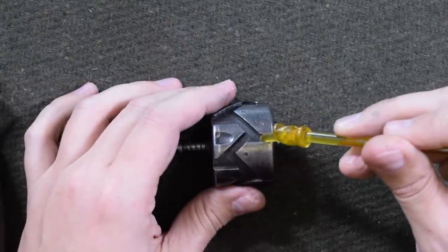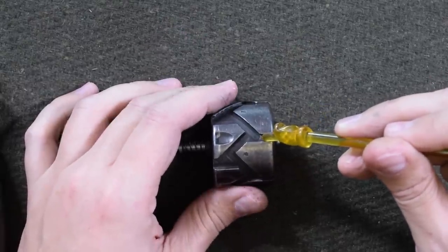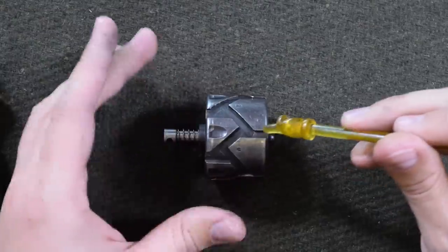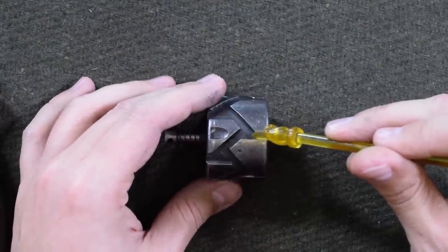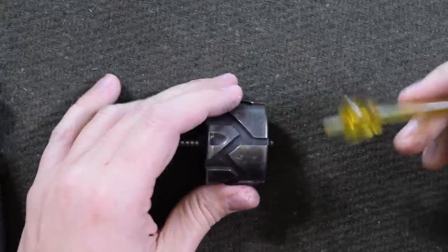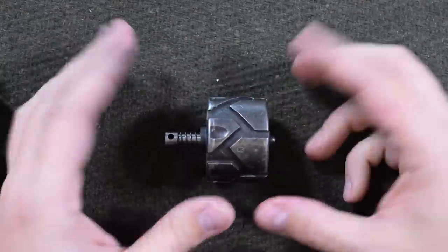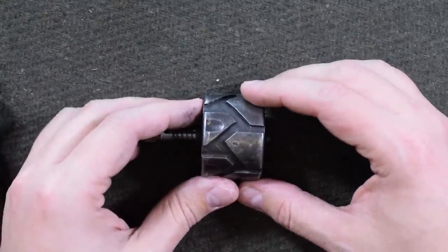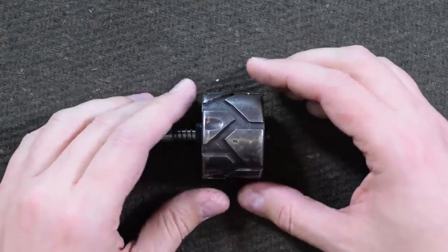So what would normally be sort of your in battery lock is now just the position of that pin. So it really does simplify the revolver in a lot of ways. And again, boom, and we trace and boom, right? You guys get the idea. It's a super simple mechanism, but again, one that's prone to outside fouling because it can pack into these grooves and therefore we're no longer describing the rotation of our piece.